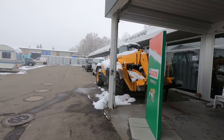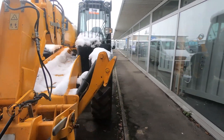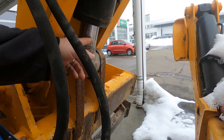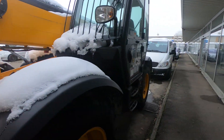It has become winter by the way — snow has fallen. I jacked up both the JCBs to see if there are any problems with the hydraulics, and what we've discovered is that this particular section sank, which means that this particular hydraulic cylinder is leaking somewhere. When we send these to Senegal is when we're really going to fix it.